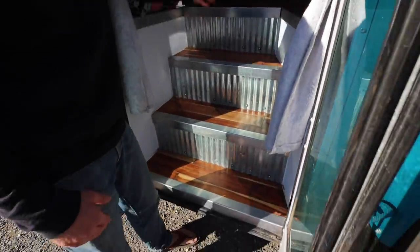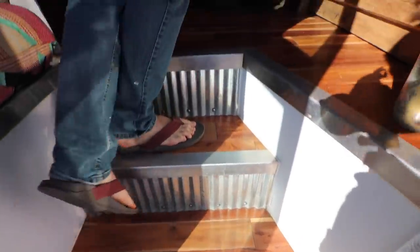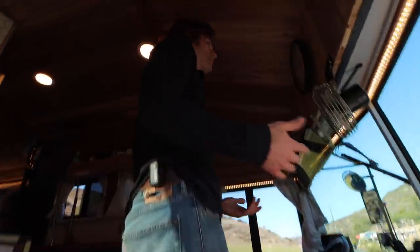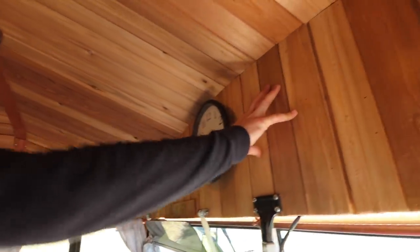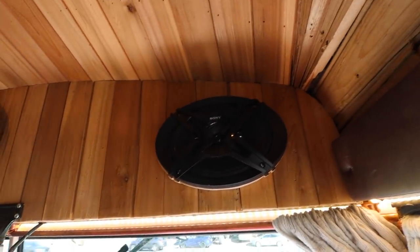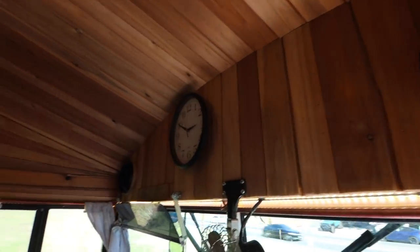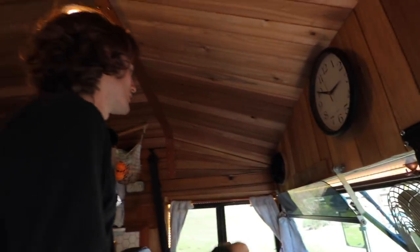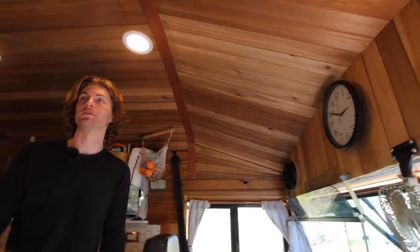We really cleaned this up — we actually have about five inches of subflooring, radiant tubing in the floor, four inches of rigid foam insulation underneath, and we cleaned it up with this hardwood. This is a tobacco acacia hardwood floor — pretty good, pretty durable, weather-resistant tropical wood. This is all cedar; I've got some friends in Michigan who remodel saunas, so this is all old sauna wood, from a sauna like 30 years ago. We hand-planed every piece down — took me probably 10 hours.